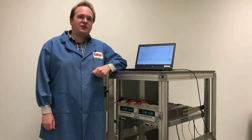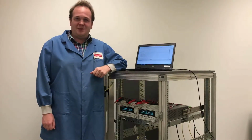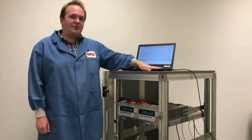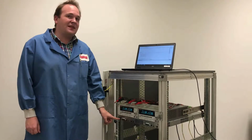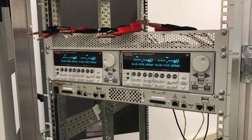In this short video, I'm going to show you how you can swap out two 2602B SMUs with one 2606B 4-channel SMU. For our setup today, we have a laptop running Keithley's Test Script Builder program connected via USB, and we also have two 2602B SMUs and one 2606B that we're going to swap them out with. Let me zoom in so you can get a better look. Here you can see the huge space savings a 2606B offers. Source meters typically require 1U of space above them for ventilation, but the 2606B doesn't have this requirement. You can see it's mounted directly beneath the other instruments.